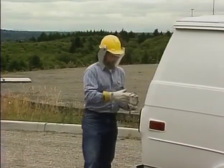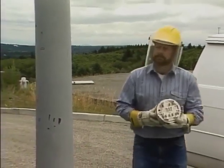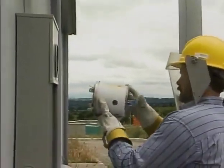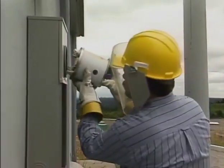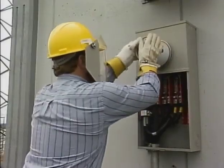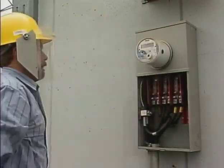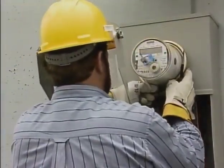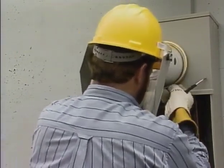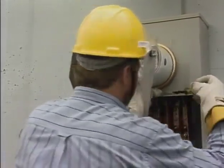All checks on the equipment so far have been positive. The socket has been isolated from any load or power source in the building by the disconnect switch. The socket has also been isolated from the terminations to each phase by the bridging nuts. So the meter technician knows that it is safe to go ahead and plug the meter into the socket and to install the retaining ring. Now all that remains is to close the meter into the circuit and the installation will be complete.